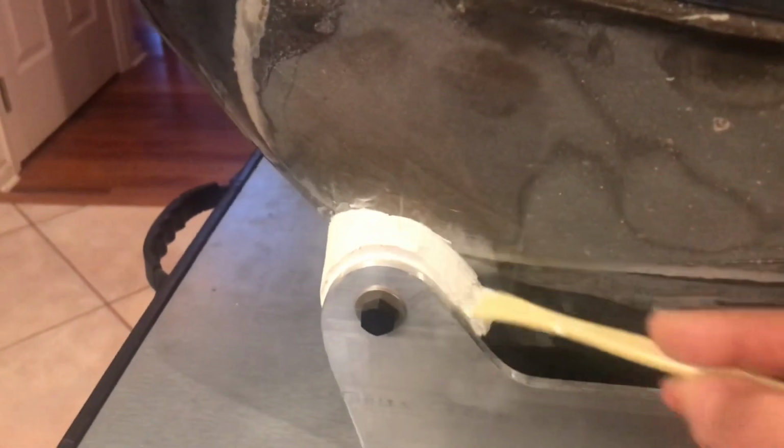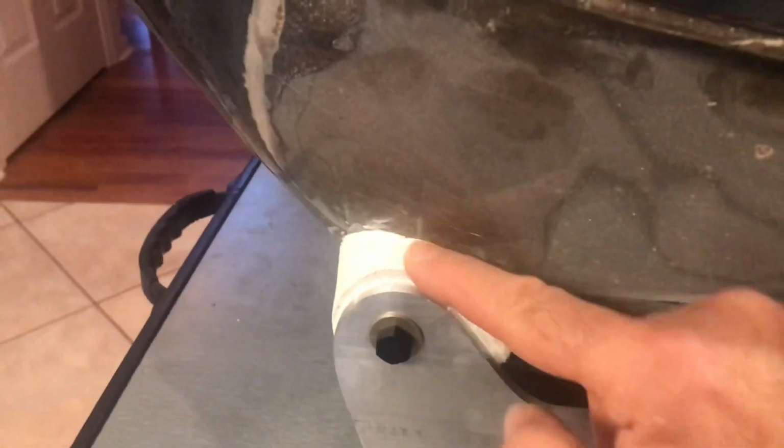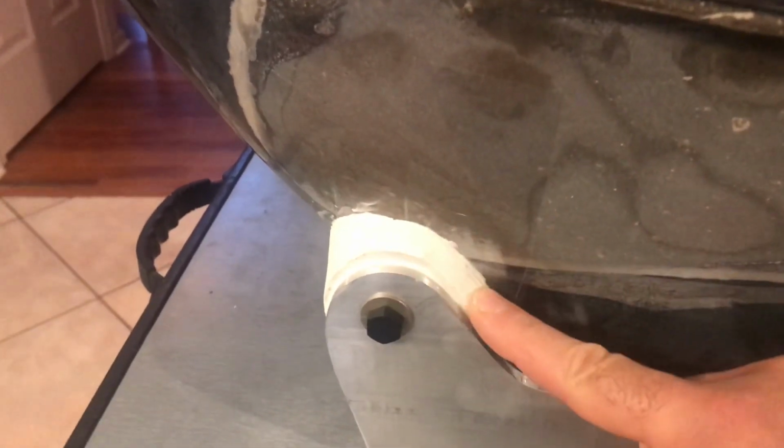I'll try to. Basically, what I do to smooth this out is I use this little rake, and I rake the clay, and then I add a little dab of mineral spirits, like this here. I just take my finger and it smooths out the ridges. So that rake levels out the clay, and then the mineral spirits and my finger smooth it out, so you can see how it's getting smooth. I'll do this 4, 5, 6 times, and then we'll take a look at it and see that the design comes out nice and smooth, so we can take a mold of this in fiberglass. Okay?